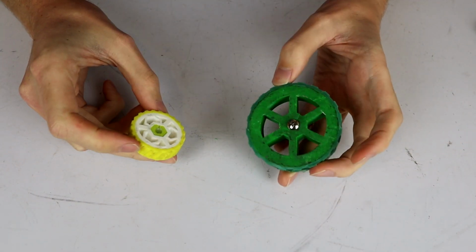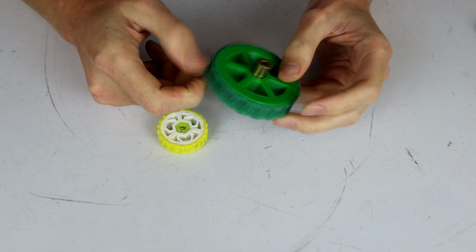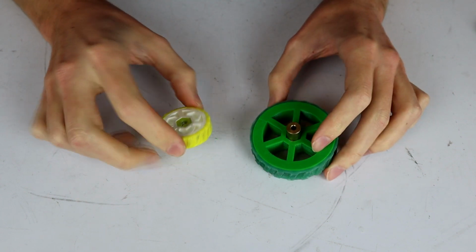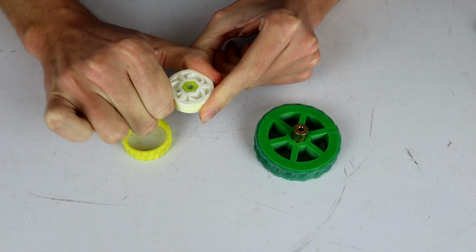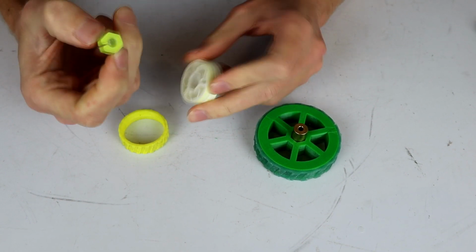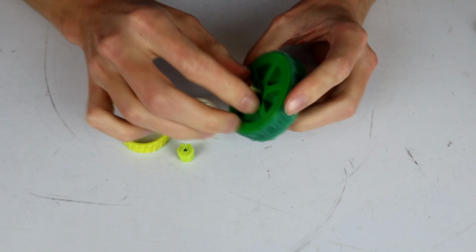But let's crack on. For a while now, I've been making these 3-part wheels, and these are for ants and for beetles. I've actually even tried this technique up in featherweights as well with not great results. The 3 parts are a silicone outer, a TPU or flexible inner, which gives it a little bit of protection against spinners and things, and then some form of internal hub. So in the ant weights, it's an ABS printed hub, which is just press fit onto the shaft.